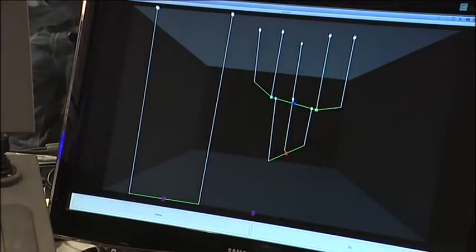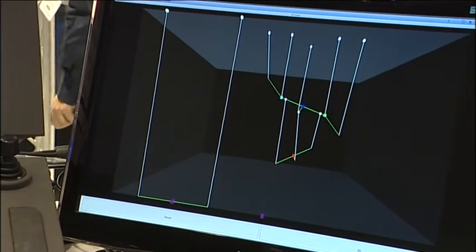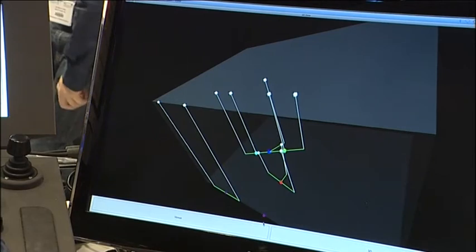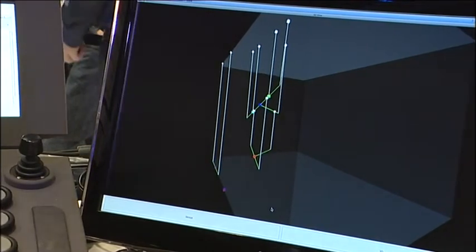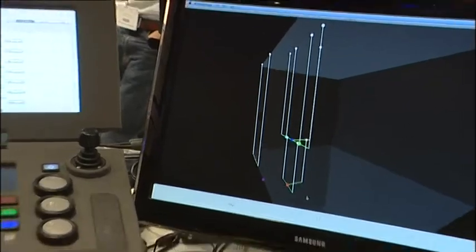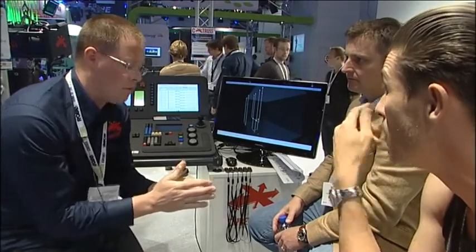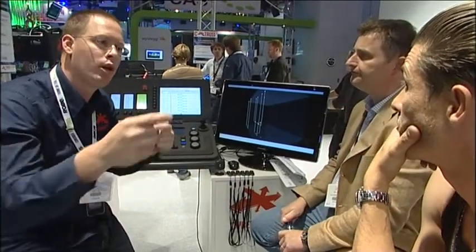We can calculate all of that to make sure we stay within the boundaries of what we've found safe. Is that gravity movement of a fixed object, or will the actual weight change how that works? The actual weight will change, yes. Obviously you've got something hung on two chain hoists or two winches — like a light bar. In your programming, can you have it at its top dead out, go to maximum speed, travel half its distance, and then decelerate to only 25 centimetres per second? We're time-based in our programming, so I look at what the designer wants in time rather than speed.